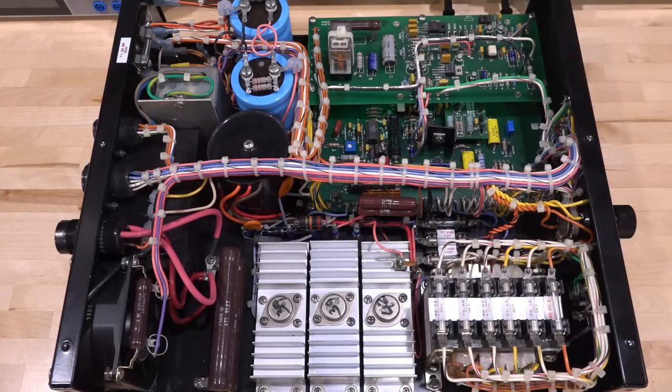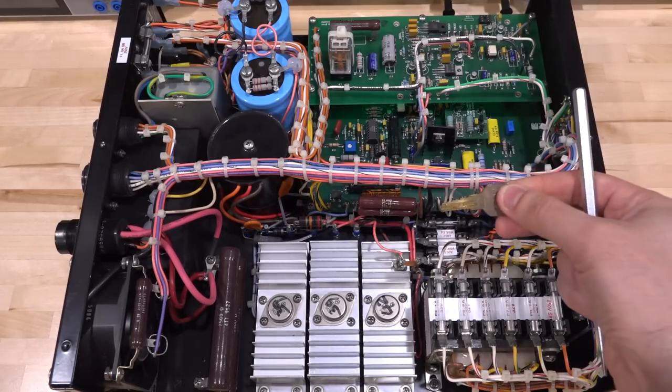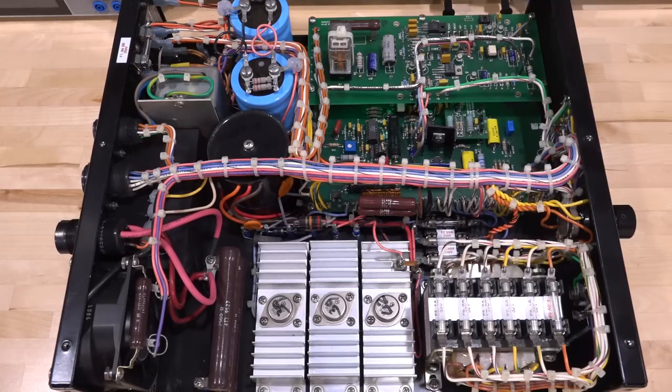There is a full-bridge rectifier going into these big capacitors with discharge resistors, and the rest is essentially analog circuitry — I don't think there's even a microcontroller in any of this; it's all done with classic design. The key on the front allows you to shut the laser down in an emergency without going through the proper shutdown procedure. That's what causes cadmium buildup on the mirrors, so you really have to use this only in a true emergency, otherwise you will lower the lifetime of the laser or damage it.